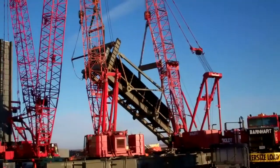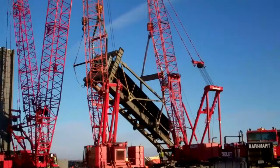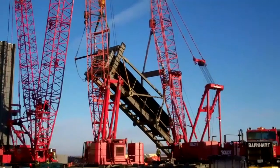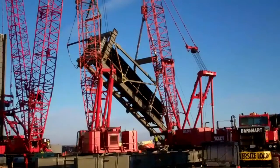What's happening now is what we call the upending of the module in the frame. The module goes from flat or horizontal orientation through a 90-degree rotation to the point where it's standing straight on end, as it would in the boiler.